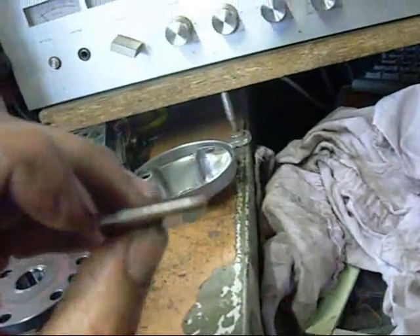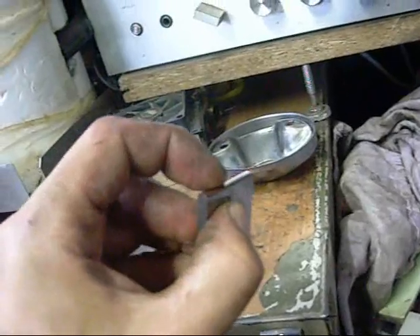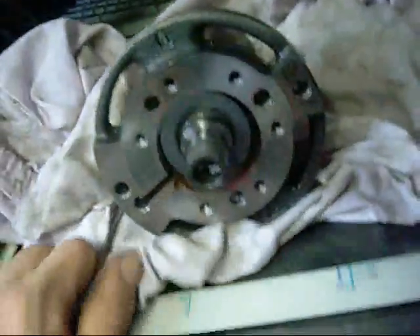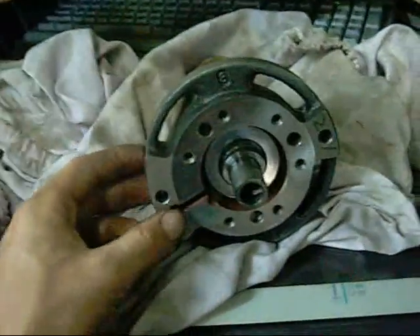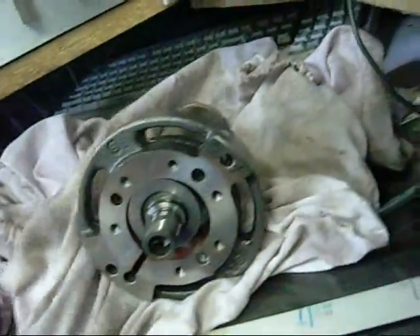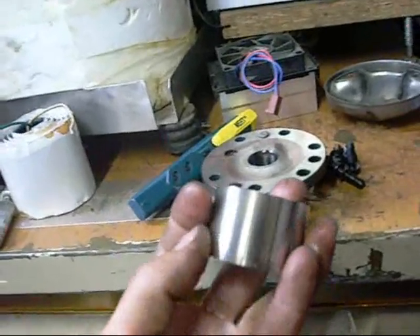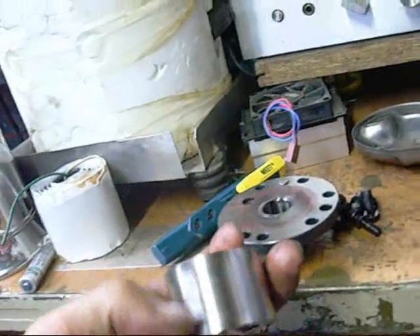Try and get that rotor out - it is hard chromed and definitely showing it. I've never seen a vane with wear like that on it - I'm going to put that in the hall of fame. Part of the radius doesn't continue around like that, but normally it's got a flat spot on it with lots of grazes and deep wear. So yeah, this compressor has had a hard life - it's not just the vane spring. But the vane spring is why it would have significantly increased the amount of noise, until it built head pressure and pushed the vane in anyway. But it also still affects the bottom end of the pressure scale - on a coolish day this unit wouldn't have done much at all.